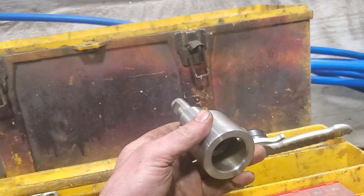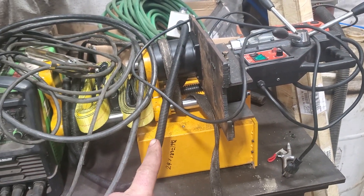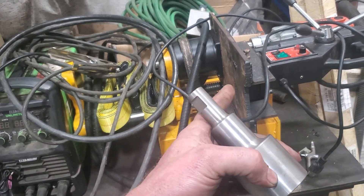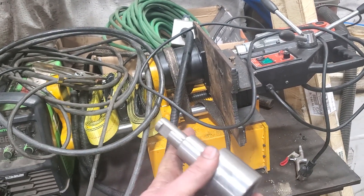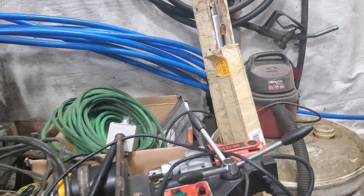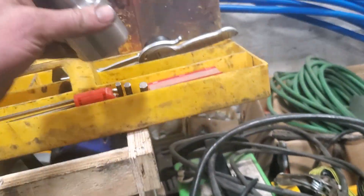I also have some tooling drives — I have three of these that I manufactured. So if I cannot get the line bore set up into a confined space, I have another standoff that I made that welds to the bearings. This is a three-quarter shank machine for the boring bar to fit the end of the boring bars, so I can direct drive those two units together with this to complete my bore.